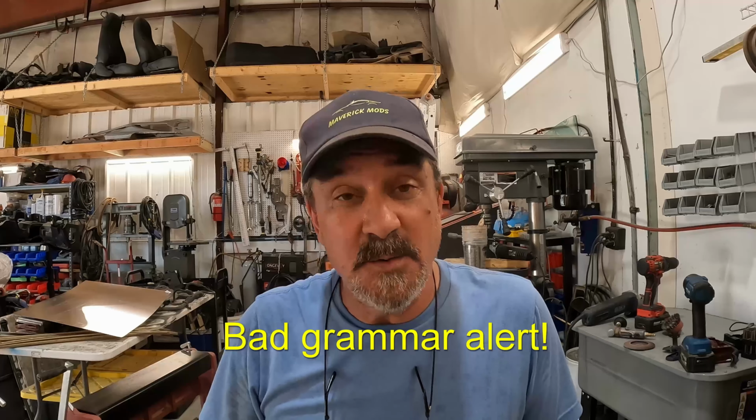All right, so let's talk about heat control for a second. Believe me, nobody enjoys driving a car around for a couple of hours when that header is just cooking your right foot. Not fun at all. So how do we prevent that? Well, here's my theory, and I think this is probably pretty valid because most of the manufacturers have been doing this for years. If you allow the heat to get to the floor, you've lost the battle. Because then you're trying to mitigate that heat propagating beyond the floor and up into your feet. If you can reflect, deflect, or otherwise stop some or most of the heat from getting to the floor, you're way ahead.